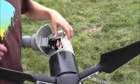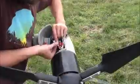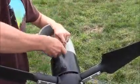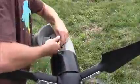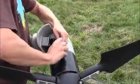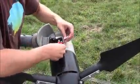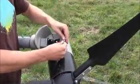To finish off wiring up our system, we're going to use our yellow wire nuts to connect our red one, our white two, and our black two with our stator wires. We'll get those together and throw a yellow wire nut on — push down hard because these are copper wires, a little bit harder to turn than the brush wires. Get on there nice and tight, and then we'll do our last set, which is white dash, red two-three, and black dash.